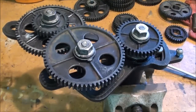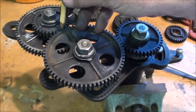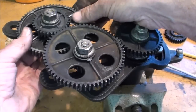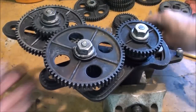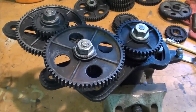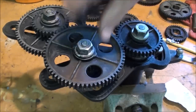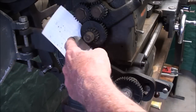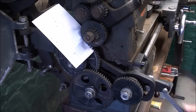There is another method of meshing — that is to use a small rod, like a paper clip, but it has to be a wire of the correct diameter, determined by charts or mathematical calculation. But evidently these are not all that critical, so I'll just do it again with paper. I've already done this one and I'll do the other off camera. I brought the gears up and I'm on the 32-tooth back here, same as before, and I've got this snugged up.